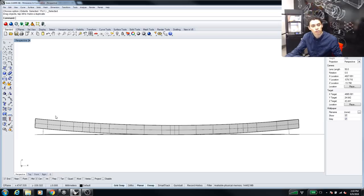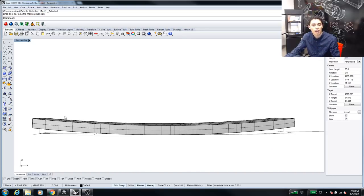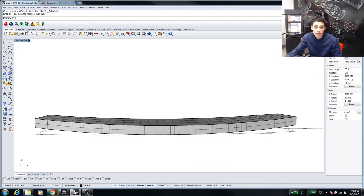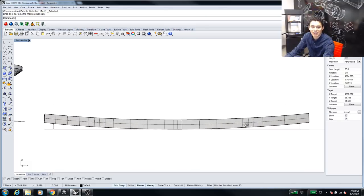And we moved on to what you see here, where the kick is happening at both ends, both in the front and in the back. And then you're left with this catenary arch that's going from front truck to rear truck in an even way. However, when we printed that one, the issue with it was, I don't know if you guys can guess it, but by having that curve guiding the trucks, even if it's shallow, you're putting so much pressure already in the board, right? So it's acting like a spring and it's already bent. There's not much room for it to go other than to snap, which actually happened.